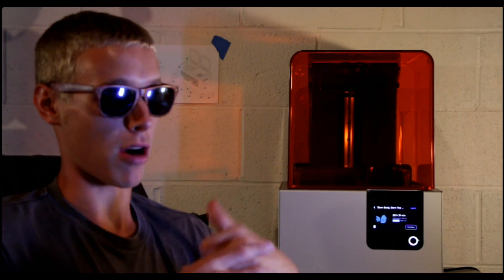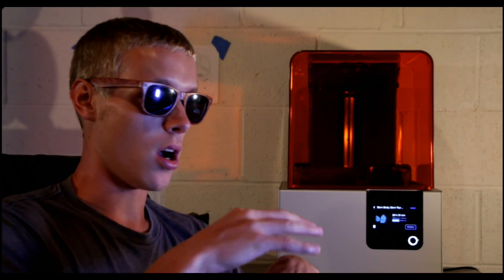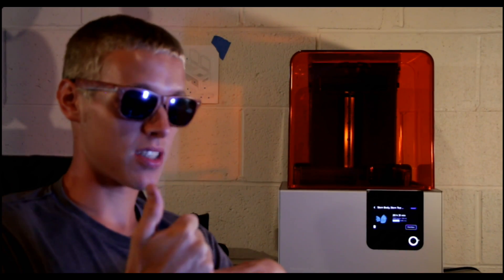The reason why I choose this printer to print the bike parts, as opposed to my FDM printer — even though it is a lot more expensive and uses a lot more material — the quality is an order of magnitude nicer. One of the biggest problems with an FDM printer is that when the filament is getting laid down layer by layer, you get these little air gaps and pockets that can weaken the structure. With an SLA printer, that's not a problem. Also, it's a lot easier to tell the individual layers visually on an FDM printer, whereas with an SLA or DLP printer there are no visible layers, because all the printing is being done inside the resin. Because there are no air gaps, the part is a lot stronger — that's why I use this printer.